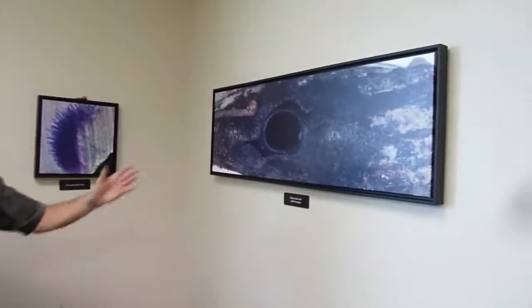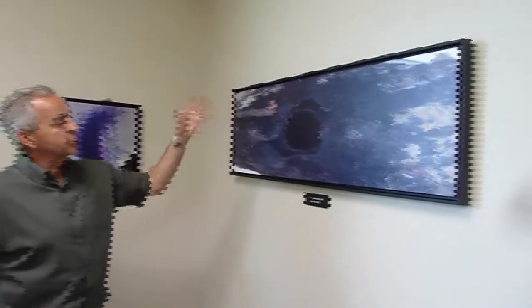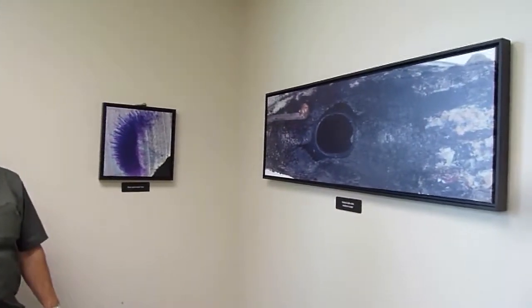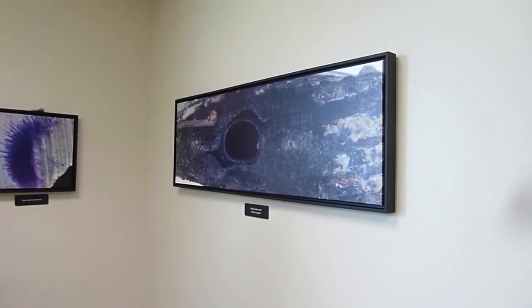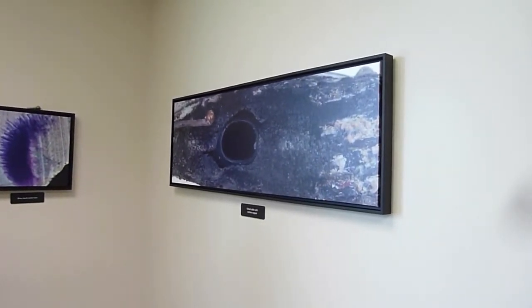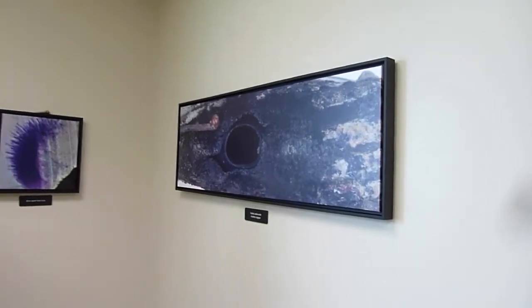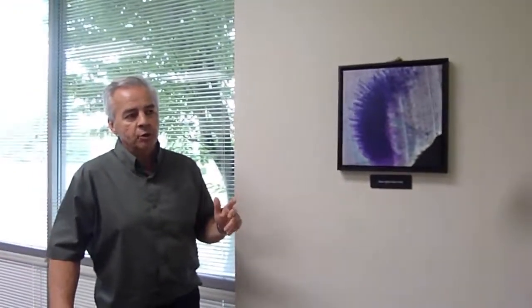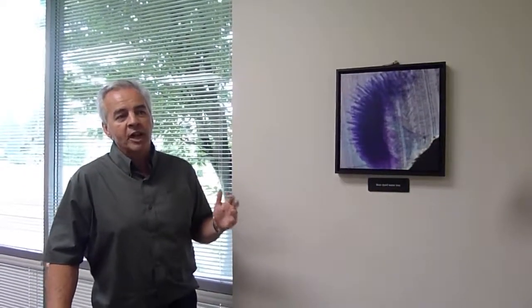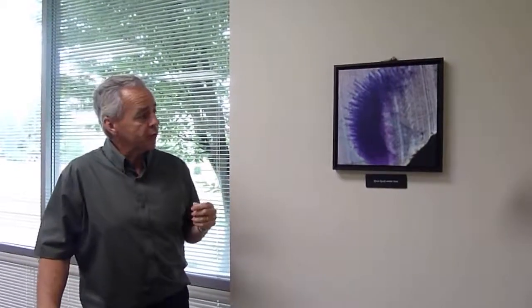So remember before we saw one failure. Here's a failure with an even bigger hole. Again, we have the melted copper. I call this one the black hole because you look inside and you see nothing. So it's just, again, an interesting picture of a fault. And as you can imagine, you cannot find out what the cause of that fault was because whatever it was is destroyed in the explosion that occurred. By the way, when a cable faults, I told you the temperature before, but it's typically 20,000 amperes of electricity. So that's just a whole lot of energy released really fast.